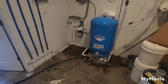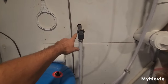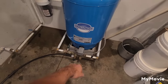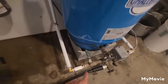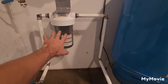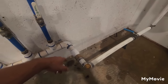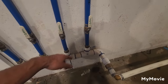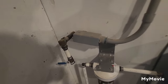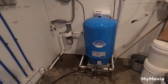It's been about two hours and I went ahead and re-did the entire system. This is the pipe coming in now — it goes down to one-inch PEX, switches over to a regular old pressure switch. Kept the original valve, changed the filter to the right direction, and it adapts back over to PVC to the original manifold going to different sections of the house. Now we're going to perform a pump test and see what the system makes.